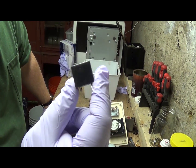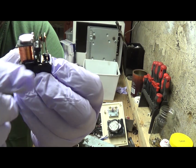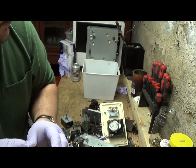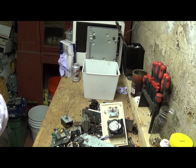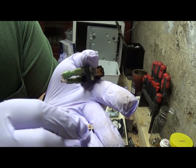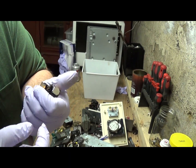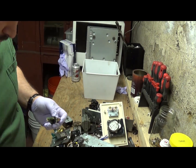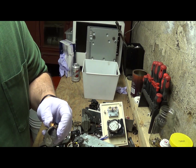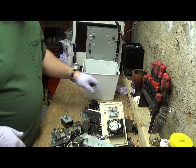You're also going to find a lot of little boxes like this on circuit boards. They're called relays, and if you open them up, you'll find a nice little spool of bright wire copper, and you'll see these two little flaps on the end. Right there — that is a silver contact. How to remove that? Wicked simple. You take a pair of wire cutters, get close to it, and there you go — you've just removed it. Yeah, there's still a chunk of copper to it, but that's fine. When you process that in the acid bath, it's going to come right off. Don't forget the other silver contact on the other side. Whether you choose to use nitric acid or AP, it doesn't matter — the base metal is going to disappear, leaving just the silver. Nitric acid works a lot faster; AP works a lot slower, but it's the only method I use.